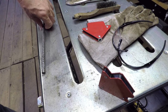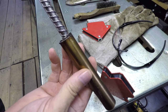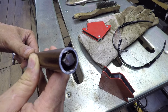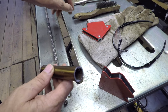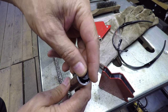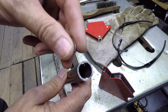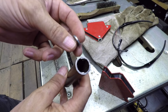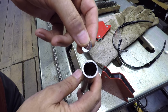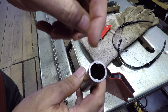Something I didn't anticipate — I guess I didn't put enough thought into it — the diameter of the hole in this tube versus the diameter of the rebar. I've got quite a gap there that I have to overcome if I'm going to weld this, unless I just weld it like that, but I want it more or less centered. So I found some washers with a quarter inch hole which is too small, I have to drill it out, but I'm going to use a magnet. This fits in the pipe basically almost perfectly — still a little bit of a gap, but I think I can put some small tack welds. Since I'm a new welder, I recently learned that if I turn my welder down on low or minimum and a wire speed of about 1.5, and just do a series of tack welds, I can weld this thin stuff without burning through. I'm going to try that.